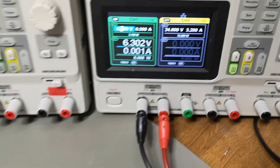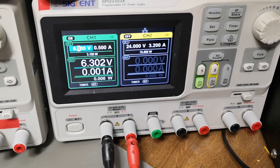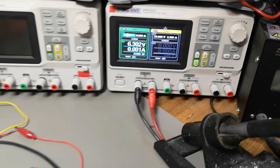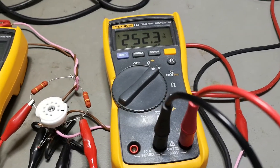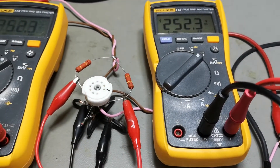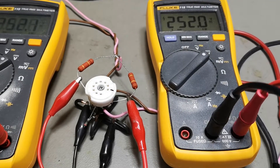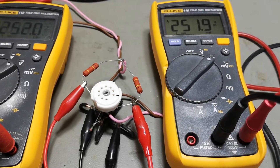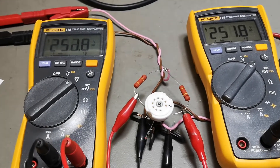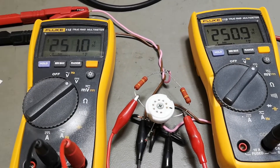For my test I use a regulated DC supply with a current limit of 500 milliamps, because the filament of a hot tube will consume about 300 milliamps. I really like to use a current-limited supply for the filament so I don't see any flash-up when I start up my tubes. If you use a power supply capable of delivering many amps, the filament will light up really too much — in a real circuit you'd have a supply that's not too strong for the job.